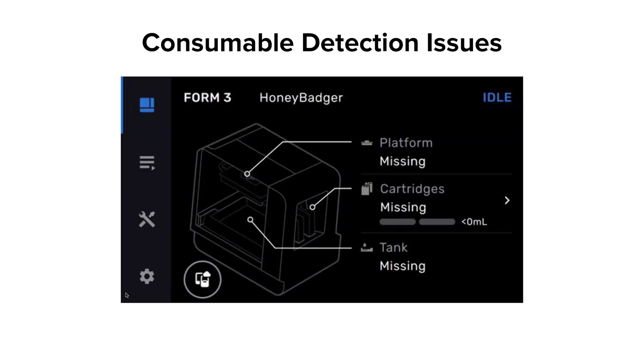While you wait for your detection issue to be resolved, you can turn off Build Platform Detection on the Form 3L by going to Settings, then Printer Details, then Subsystems, and selecting 'Turn Off Build Platform Detection.' You will be asked to manually confirm that your Build Platform is inserted and ready for the next print, so press 'Yes, it's ready' only if a clean platform is in the printer. Be aware that turning off detection carries the risk that a user could start a print with no platform installed.